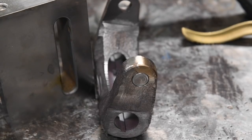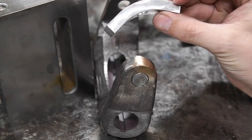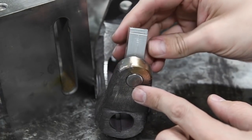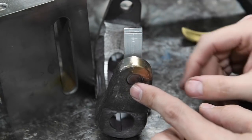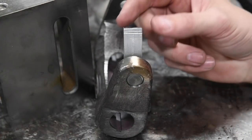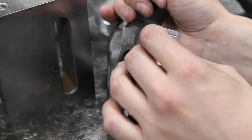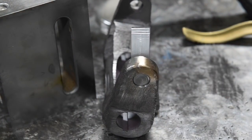Let me show you my little prototype that I made out of aluminum - just kind of a see-what-would-work, milled out of a piece of three-quarters stock. Nominally these things are five-eighths wide. The bronze one will sit in something like that, and then you can adjust it in and out depending on where you need this guy riding on the actual shaft, and then just lock it in with the set screw. There needs to be enough clearance so that on all sides there's actually oil, not metal-to-metal contact. And then when you shift the lathe in gear, this thing can pivot just a little bit to move along with that shaft.